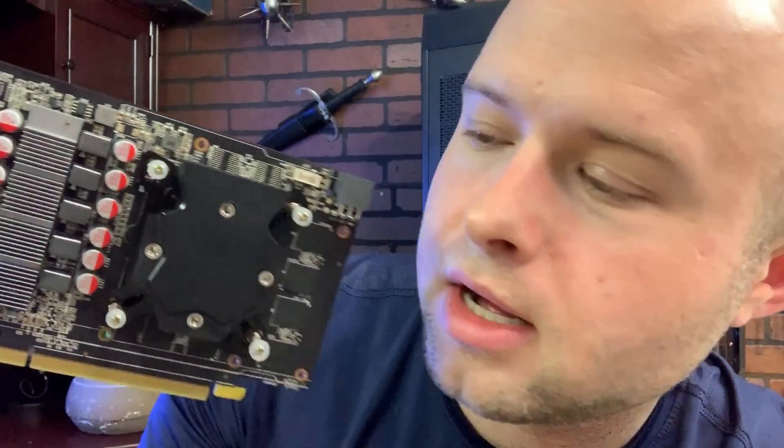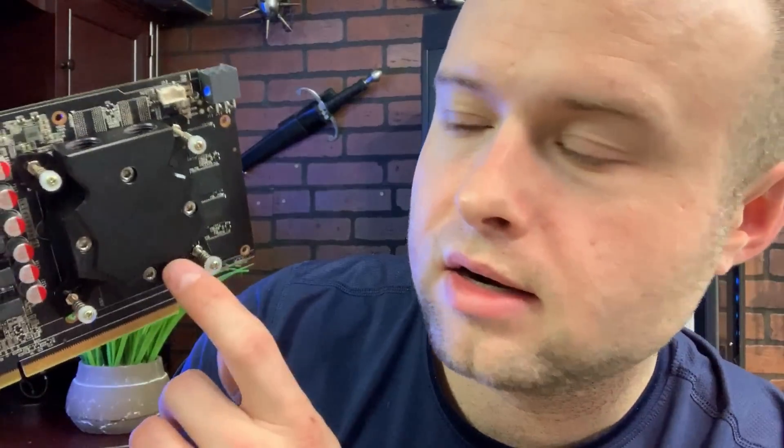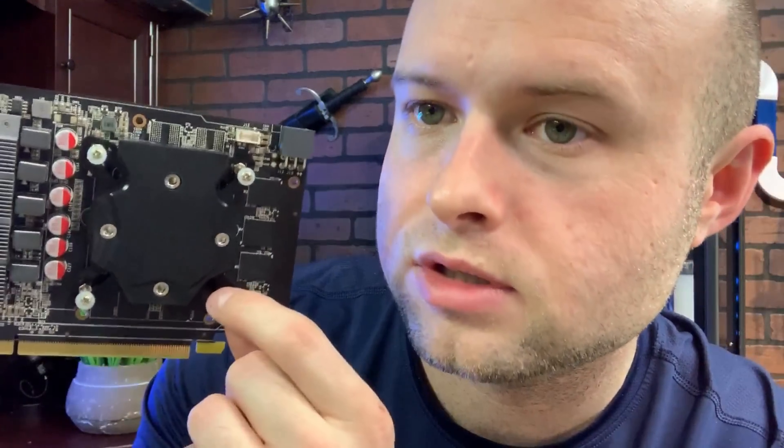So for the GPU, I'm going to be using this 1060 six-gigabyte. It's another busted GPU. I was doing my water loop cooling experiments and I think I just let it get to a temperature — when you hook it up, it only hashes at like two mega hash per second. My thinking is I've killed part of the core. Anyway, I'm going to leave this GPU water block on there. It's a cheap block on Amazon, link in the description below. These work good, but they don't do much to cool the VRMs or any of the other components of the board or the RAM — but it works good for the GPU itself. So we're going to be using this again. It's mostly for looks.